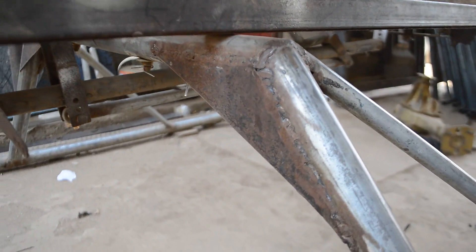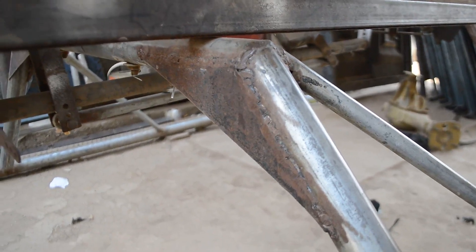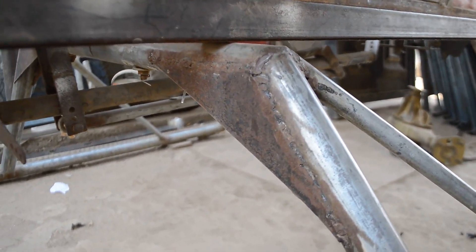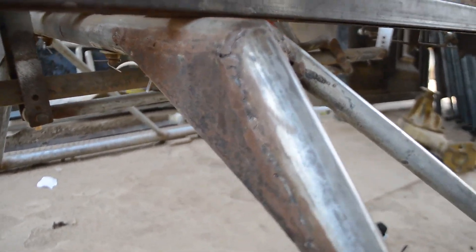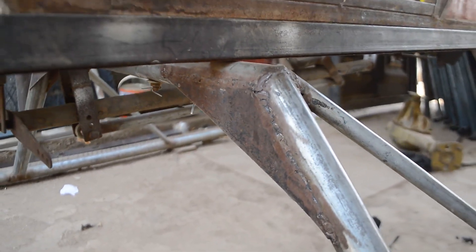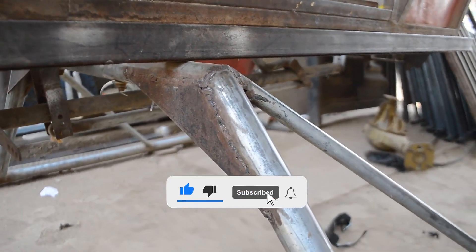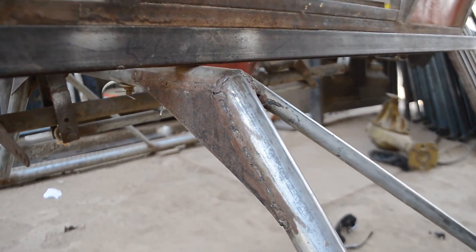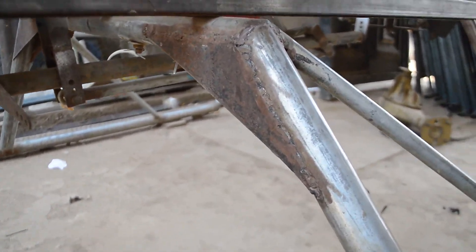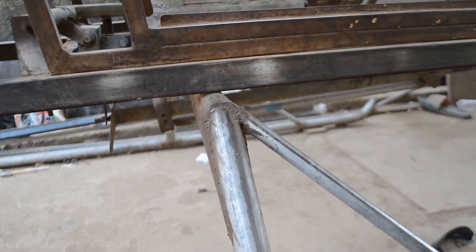What is ground resonance? Many of you don't understand what it's all about. Ground resonance is an occurrence where a helicopter lands and there's a serious vibration that can tear the whole helicopter apart — the helicopter will just go scattered and shattered. Ground resonance can easily destroy any type of helicopter very quickly.